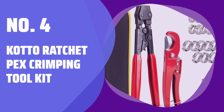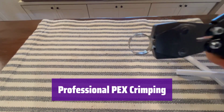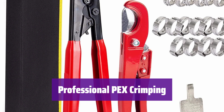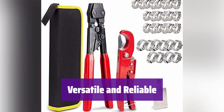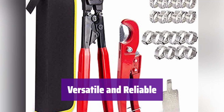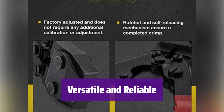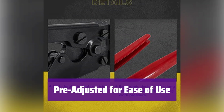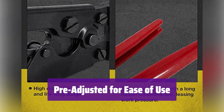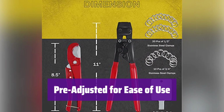Number 4. KOTTO Ratchet PEX Crimping Tool Kit. This handheld tool features a remarkably efficient ratcheting mechanism and a top-tier crimping die, ensuring consistently reliable crimps every time. It's perfect for a variety of applications. It meets ASTM F2098 standards and works with stainless steel clamps from any manufacturer, handling PEX connections from 3/8 to 1. It also cinches hose clamps. This tool comes pre-adjusted, so there's no need for extra calibrations. A bonus calibration tool and upgraded storage bag are also included for convenience.